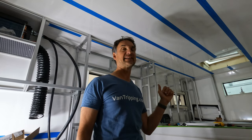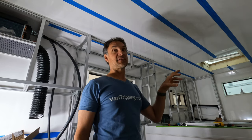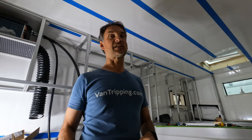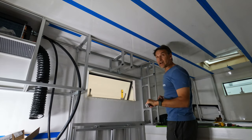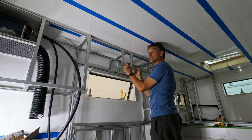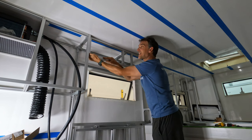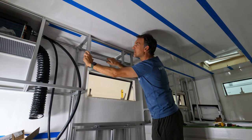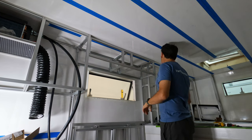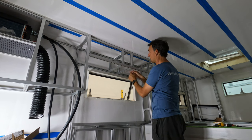Now I'm finally building these overhead cabinets — the last cabinets other than the very front bathroom cabinet. There's still a lot of detail work: plumbing, heating, air conditioning, and electrical to run through these cabinets. Right now I'm just finishing this up. I'm using these end fasteners — they are so strong, hidden, cheap, and light. Being hidden, I can cover them up with my facing material for this cabinet and the fasteners won't be in the way. I just come down to the end, get it lined up, and assuming my dimensions and access holes are correct, it goes right in.